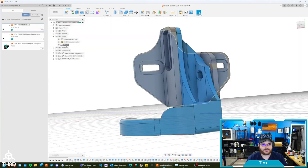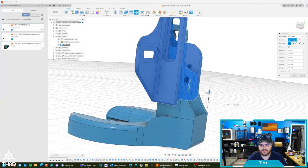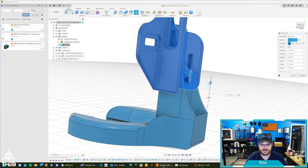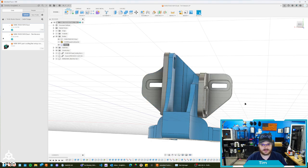This is a completely new design, and the cool thing is this mount has a ton of adjustments — we can move it up or down with a total range of motion of about 14 millimeters. This allows a lot of height adjustment depending on whether you have the SV06 or the SV06 Plus, so both printers can use the same plate.